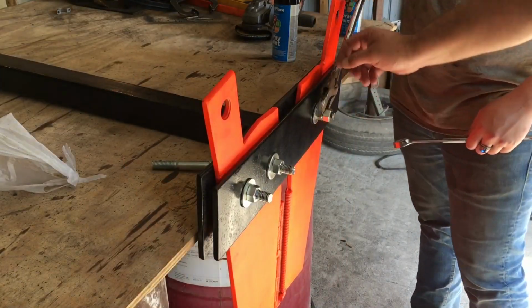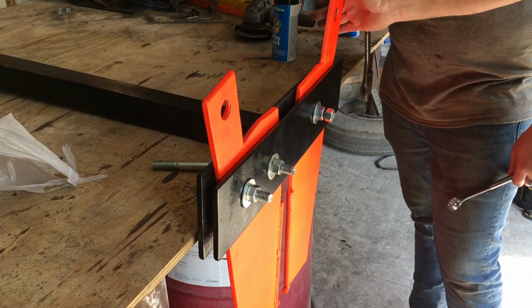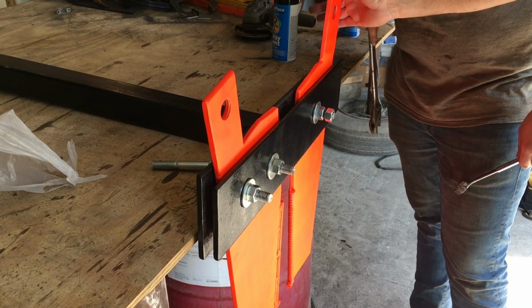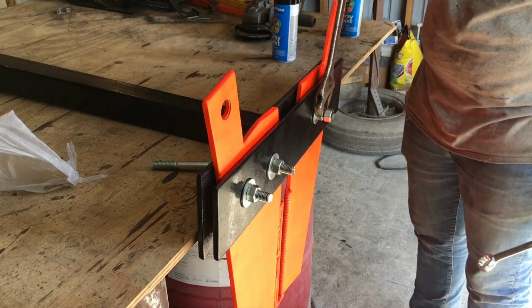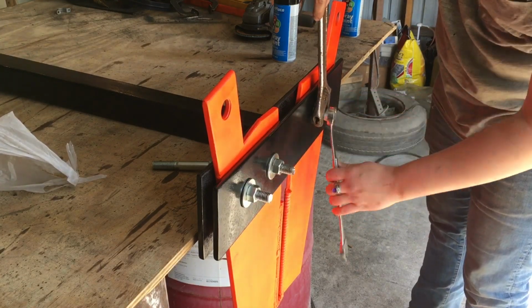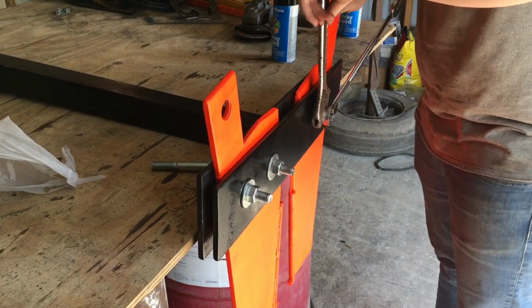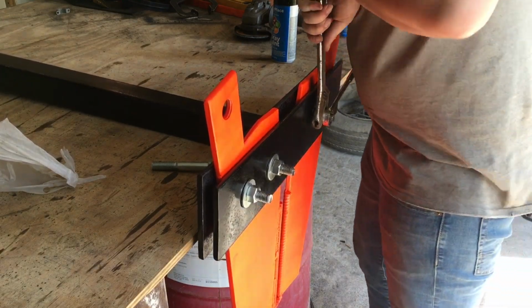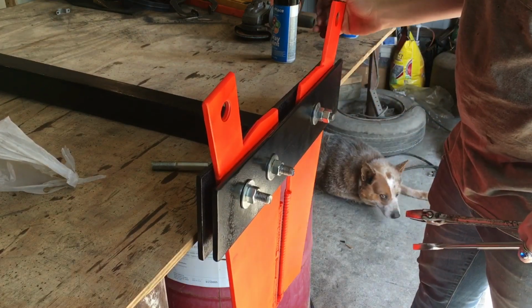Alright, what we're doing is we snug this nut, that's just a free nut. We snug this up until you feel a little bit of resistance on it. And now he's going to run this jam nut up. That way it doesn't come loose when they're using it. You have to keep checking it because sometimes they'll tighten up when you're trying to jam your nut down. Perfect.